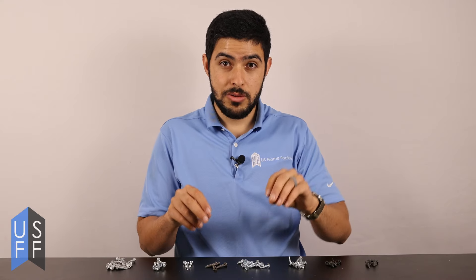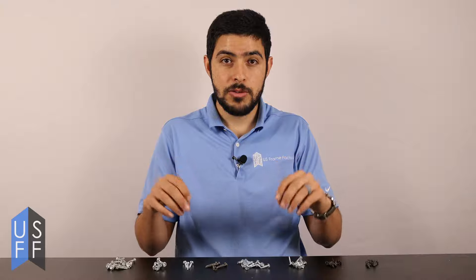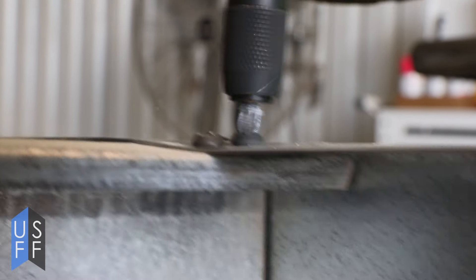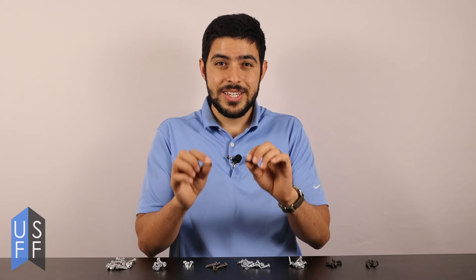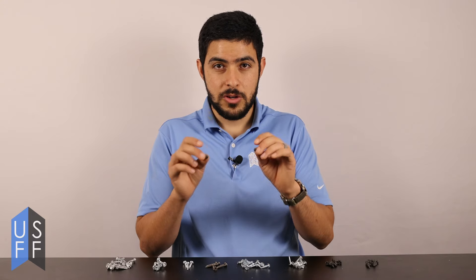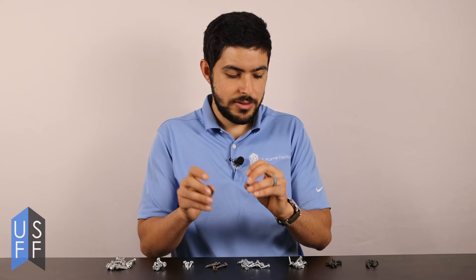If you work with 0.023 to about 0.043 inches, then you want to start looking at that driller tip because it'll go through the metal and actually drill a hole. These are really nice small low-profile screws and you get a lot of them in a box. Framers love them for large projects that are just interior build-outs.